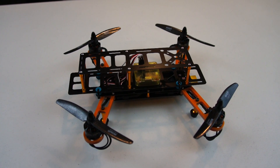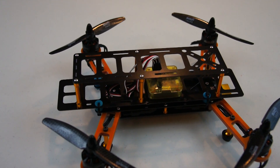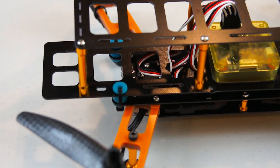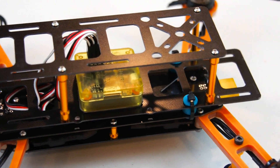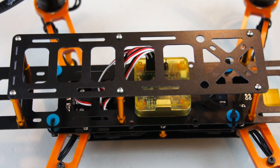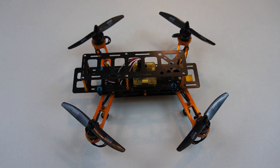I've gone ahead and finished the build on this mini 250-size quadcopter. The props are now on the motors. I've attached the upper deck to the lower deck using the rubber bobbins, and I've also added zip ties around them as a safety feature — just in case the quadcopter gets in a crash, that way the upper frame won't separate from the lower frame. Temporarily I have the speed controllers wired up to the control board, and I'll be going over that in the next video when we do the radio setup and setup of the CC3D board.